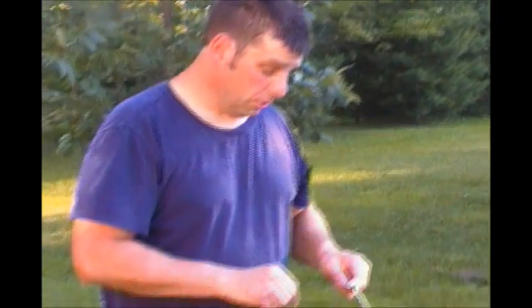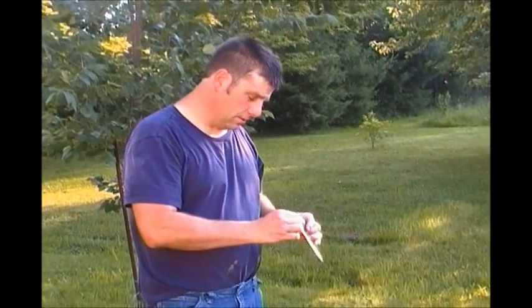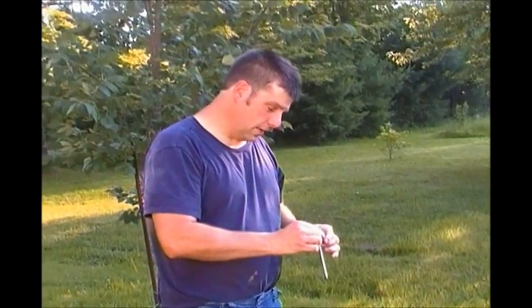The next thing you want to do is get your ambient temperature. What is ambient temperature? The outside air — not in the sun, but in the shade. That's where you want to read it. Let's say it's 84 degrees. Now we know 69 is our wet bulb and 84 is our outdoor temperature. So now what are we going to do with that information? We're going to find out what our superheat is by just using that.